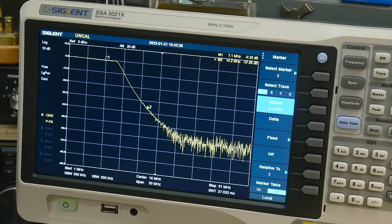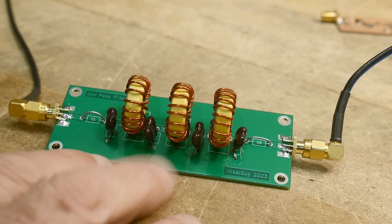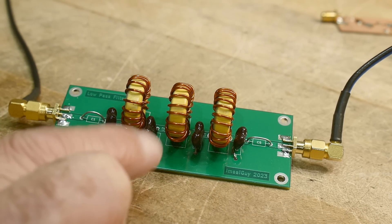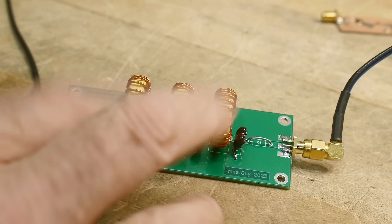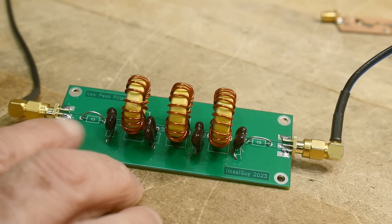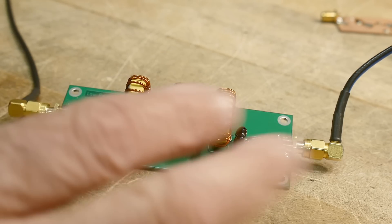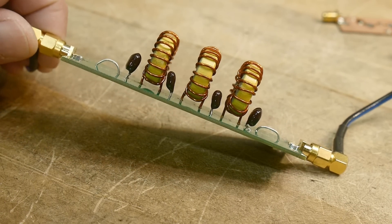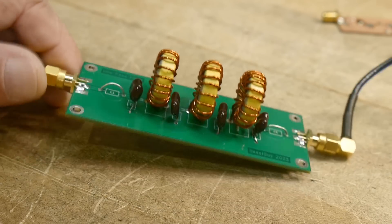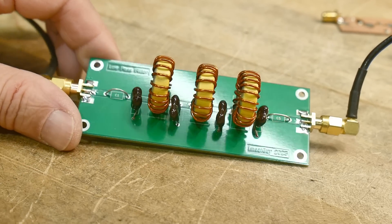It's basically a flat filter, so you can use it for anything below about eight megahertz. So there you go — now I have boards for prototyping different filters. I'll make these available on my share site on PCBWay and put a link below where you can order them. If you want to know what values to use, I'll put the values I used in the explanation on that site. This filter design came out of the ARRL handbook, so you can find these and make them for other bands — 20 meters, 30 meters, whatever — or run it into a SPICE program to figure out what you like. The back is solid copper and the top is solid copper with just a little bit of traces.